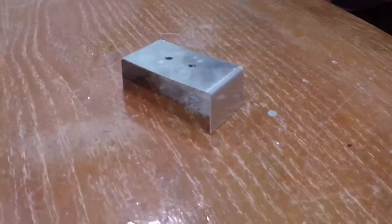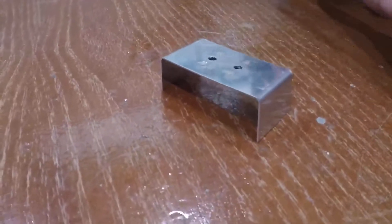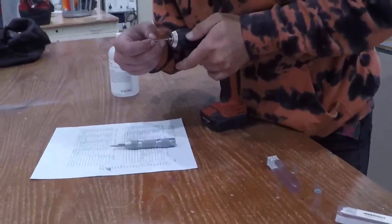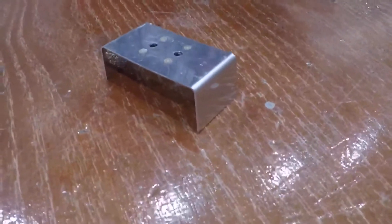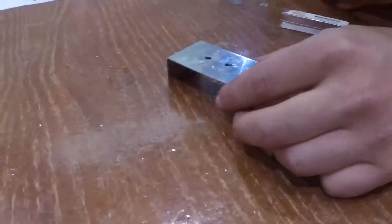The key is you don't want to drill too far down in a nut plate because you don't want to damage the nut plate at all. So he's going to put a #40 bit in his drill. In theory, if he gets right in the center, he should just be able to drill out just the head part and then the rivet will fall apart.